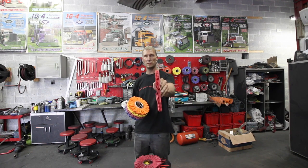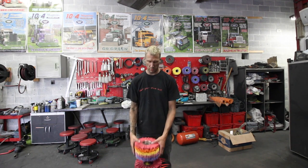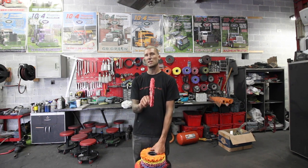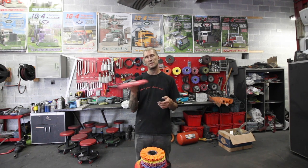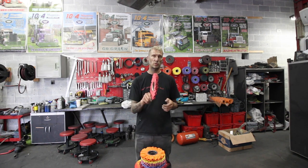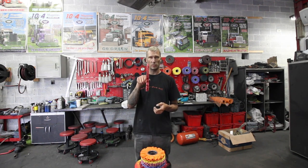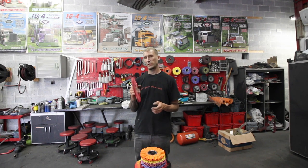The orange and the yellow, as you guys know, is part of my 2 step kit and that's the most heavily used one I use. This one here is an 8 ply hot stepper — for Peterbilt steps only. Everybody wants to know what we use the hot stepper for. Don't use it on diamond plate — it's going to tear up super fast. Only use the skinnier buffs for areas where you need to get in really tight. This would work really well on motorcycle jugs where you've got to get in the air fins. It also works super good for the Peterbilt step treads — there's that one little area where it's super tight in the middle and these 8 plys get down in there and buff in that little section. We do spin these at 6,000 RPM — just watch out; if one lets loose, let it go and walk away because it's going to blow apart.